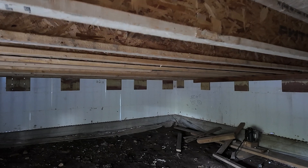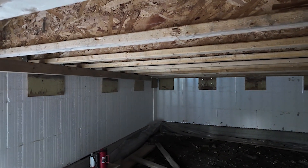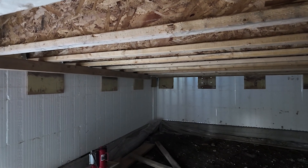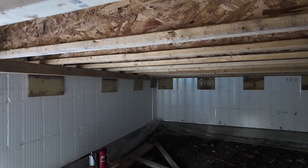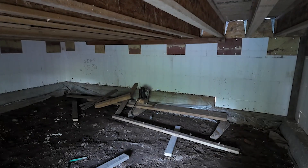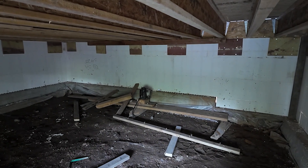So if you're in a crawl space kind of market, this is a great way to go. The day after you pour your walls, you pull your bracing and you're building walls and ceilings. It's incredibly quick and it doesn't require you to stop and pour at crawl height. My very first ICF project about 12 years ago, we did it this way — and we've done it this way ever since.